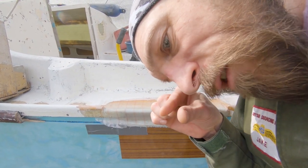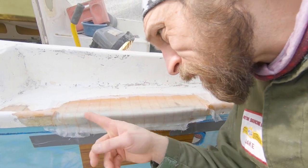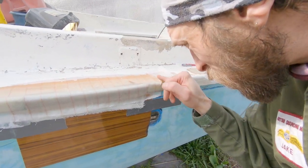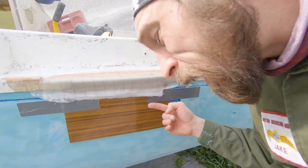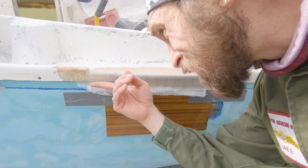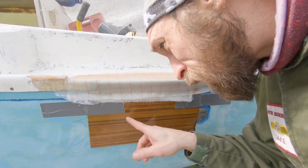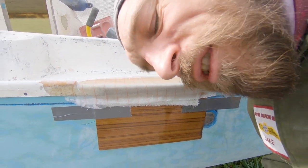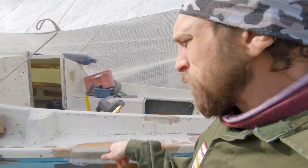So what we've done is we've sandwiched the foam core part of the deck and remade that into an edge equivalent to the underneath of the foam. Brought it down quite long here so that this is nice and flat here, and at the end of the job we just cut it off with the multi-tool, and it won't harm the hull because there's a laminate behind it. So next, after this, I'll let that go off. Then put a bit of foam on, cover over the top, not a problem anymore. Happy days! Lovely.